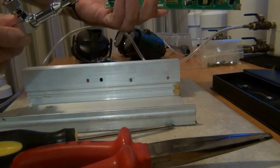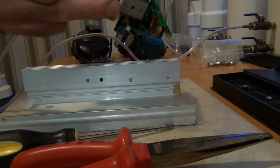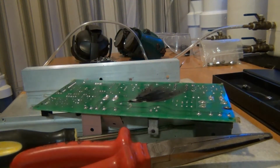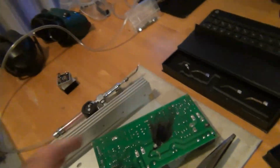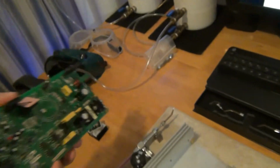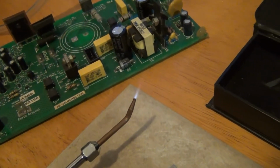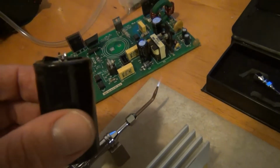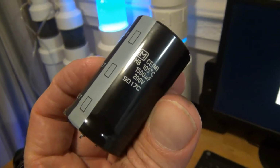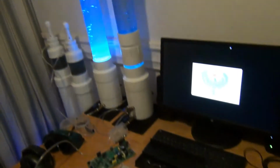See, you just go after each part like that. You pick a part that you want, you start heating these up, and then you can just pull off the electrical part from the other side. Just some of the stuff I wanted to show. That's how I get to these boards. So I was able to remove that capacitor very easily, just with that very small flame. It's very hot. There's my capacitor. Salvaging electronics using my oxyhydrogen gas setup.